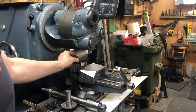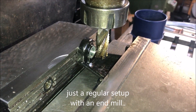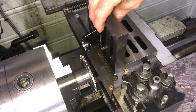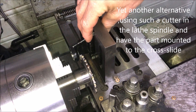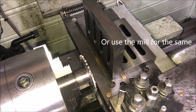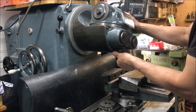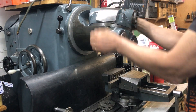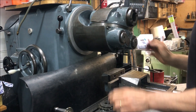Well, I could use an end mill. Apparently another alternative — at least one of them — but not the best. This would be another alternative, namely to mill off from the rear here, like so, on an angled plate, or if you have a vertical support there. I think the best way to do this, at least when you have the mill like me, is to use the horizontal arbor.